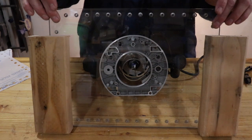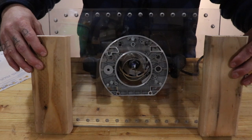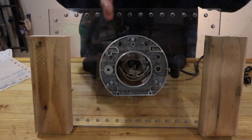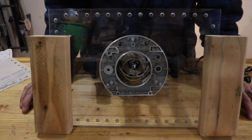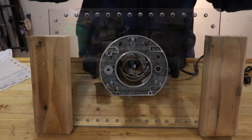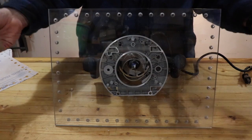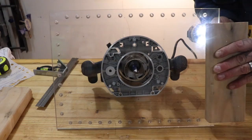And if you're cutting a certain size pocket inside the timber, if you have both of these, you can put them on and work back and forth as you're taking out all the material. Move to the next pocket you need to cut and keep going. You don't have to constantly measure and reclamp blocking on the timber.